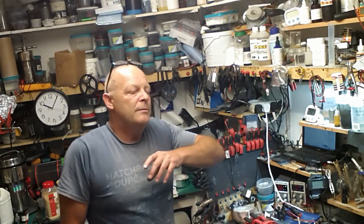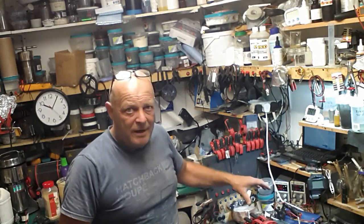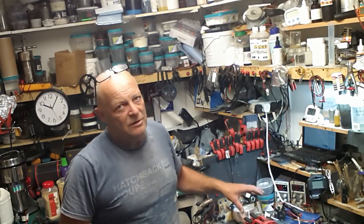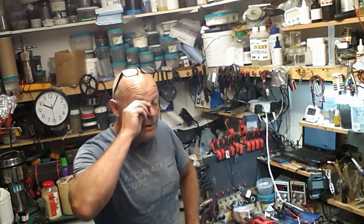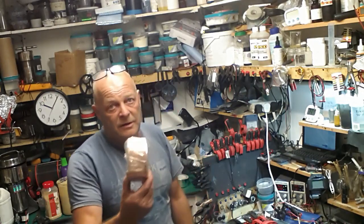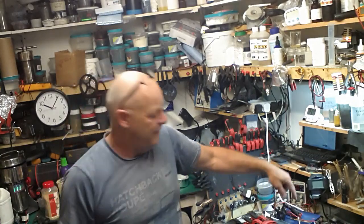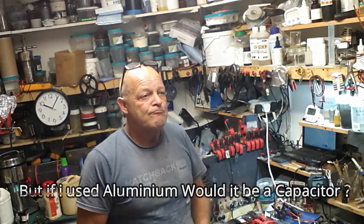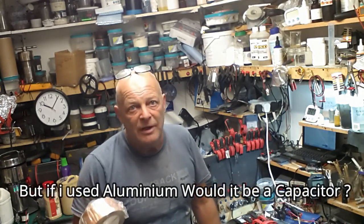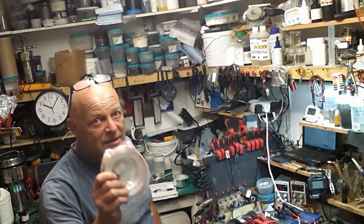And the next thing I'm going to do with this battery is swap out that graphite plate, because they are so heavy, it's a joke. And once I've done that, for a piece of foil, and I'm thinking of using copper, or maybe even aluminium, I don't know. If the aluminium, it should work, because this aluminium there, this one, is playing no part in the chemistry at all. So, can I do the same with the cathode, or the positive? Let's see. That's the next step.